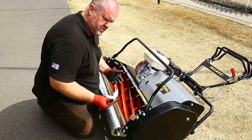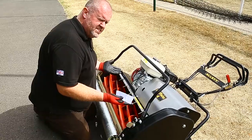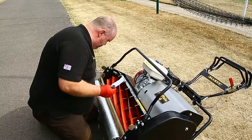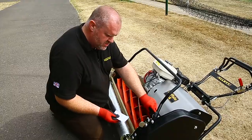What we need to do is bring the bed knife up to the cutting cylinder with as little contact as possible, but making sure we actually cut the paper — like a pair of scissors. So I put my 9/16 spanner onto the adjuster.